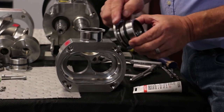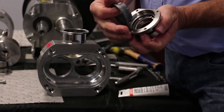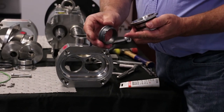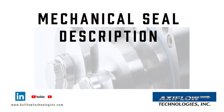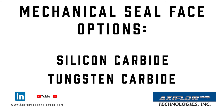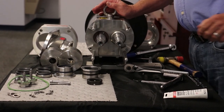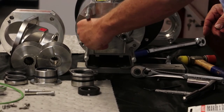Along with other mechanical seal evaluation, please check all faces for nicks, cracks, scratches, and broken portions of the mechanical seal. The mechanical seal design and configurations are determined by the end user requirements and the application operating conditions. Seal face material options are silicon carbide and tungsten carbide in the process area. Carbon and silicon carbide are used for double seals on the atmospheric area.